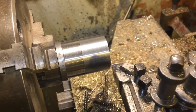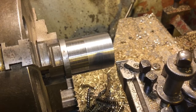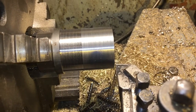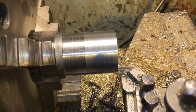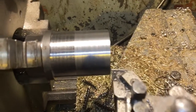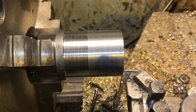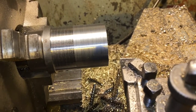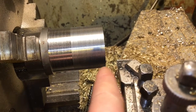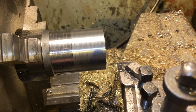We'll take a big cut with a carbide tool, see what the current goes up to, then take the same cut with a high-speed steel tool. For carbide first, I'm going to take 150 thou on the cross slide - that's total, not per side. That's going to work this lathe a little bit, but it should be okay. I'll back it off, engage the feed, start the lathe, and when it feeds in the cut starts we'll see the difference.